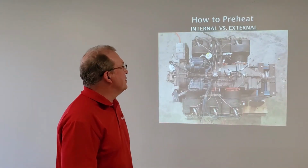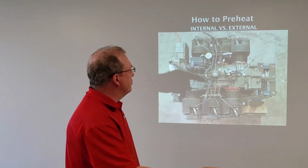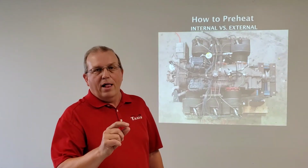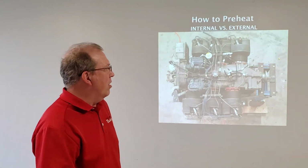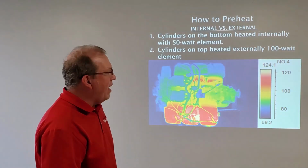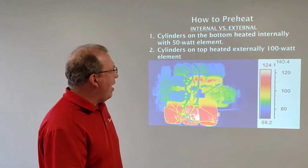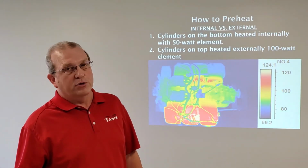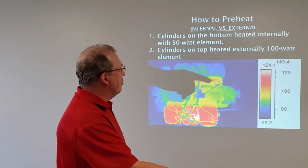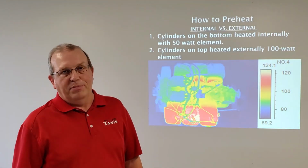We took and did a test on our system, which is located in these 3 cylinders, versus our competitors. That is basically a small thin element glued to a hose clamp mounted on the base of the cylinder. And you can see that heating from the inside out is so much more effective, and the air-cooled baffles do a very good job because we want them to. And you'll see we're 50 to 60, sometimes 70 degrees warmer than the cylinders on the opposite side.